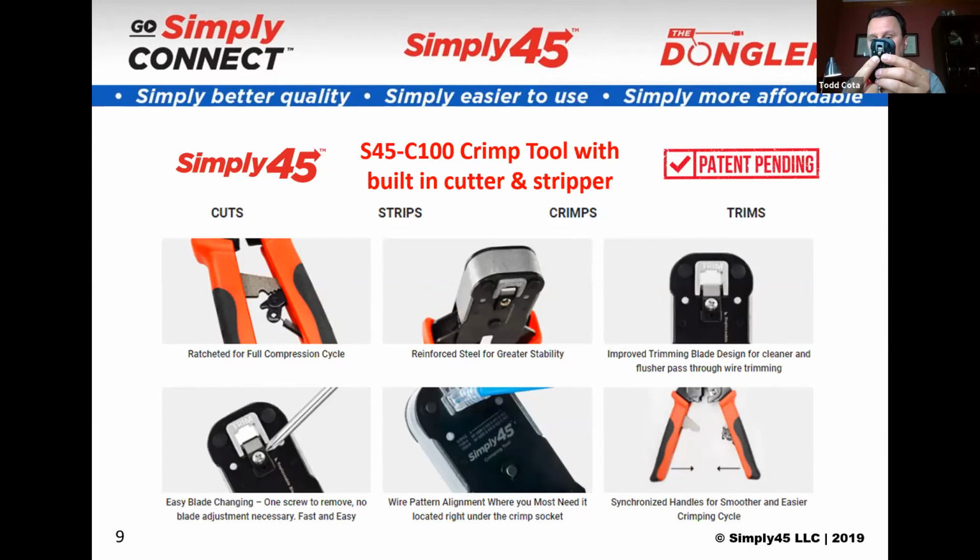You just unscrew this one screw and take the cartridge out. It's got another hole located at the bottom, so it presets everything into the right angles. And then it's just a very solid blade. We give it a life cycle of about 1,500 to 2,000 cycles before we recommend changing the blade. But it's just like anything. A blade is a very important part of the tool, and you want to replace these blades frequently. It's just part of the process, right? We're providing all these advantages, so do not take advantage of the blade by leaving it on there forever, right?